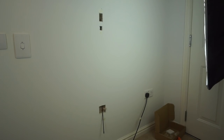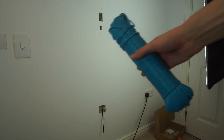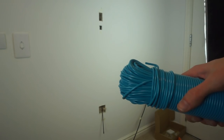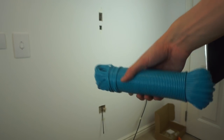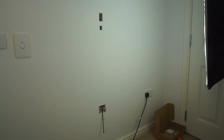The next step is to try and feed the wire. I've got some wire fishing rods and some fishing tape, but I've also got this — just plastic washing line. What I'll do is feed the washing line through first using the rods, get it to go the full route, then tie the Cat6 onto the end and pull it through. That allows me to pull the line back and add in extra runs of Cat6 from the same box. I'm going to feed the washing line from the cupboard all the way out at the bottom connection. I'm not going to film it though, since there's not much space and it's going to take hours — so I'll do it off camera and come back when it's done.